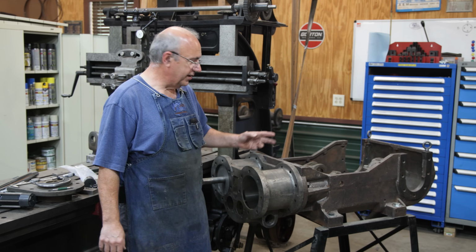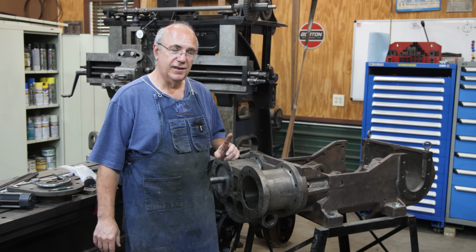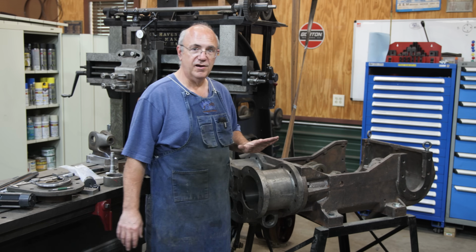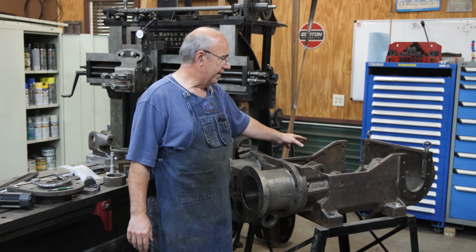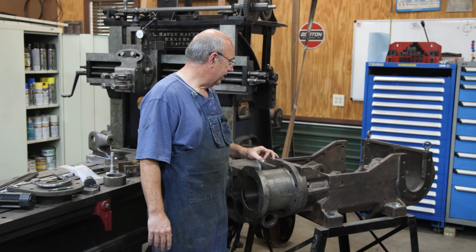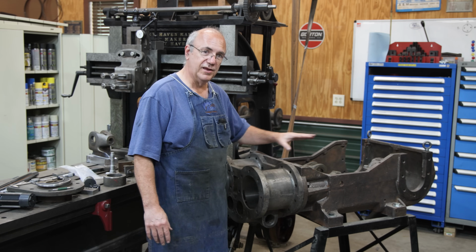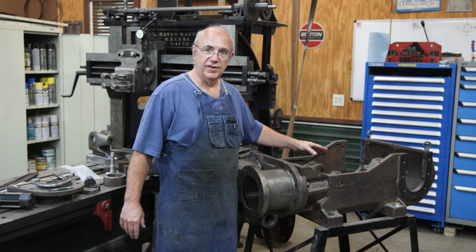I'm going to get you in here and zoom in and show you why in just a minute. But from an alignment standpoint, there was one other thing that I really wasn't taking into consideration that I need to check out before we proceed with the other one. Worst case scenario, we may have to melt that Babbitt out and re-pour this side, but I would rather get it checked out before I do the other one and have to do both of them. So we're going to take some time here and get this a little bit further assembled to verify whether or not we've got an issue. And probably on the second one, we're going to do a little bit further setup before we do the pour, to make sure we don't have an issue, even if this one works out over here.